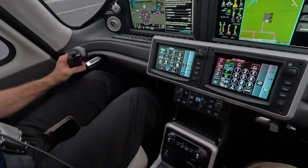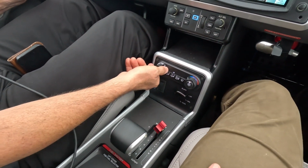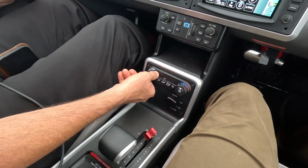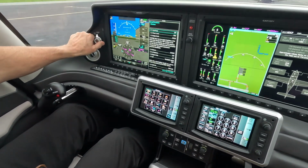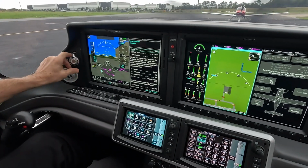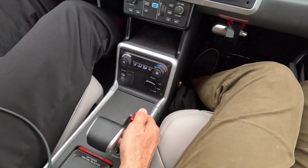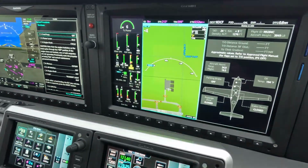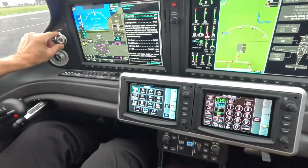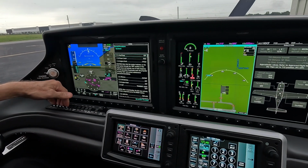From here, we're going to make sure that the AC is turned to OFF. It's one of the highest maintenance failure items we see here at PRP Aviation. So AC coming off. Going to do a hot mag check. Make sure my switches are set appropriately. And then we're going to go to idle cutoff, looking for a tiny rise in RPM during the shutdown process. And there it went up 10. My hand stays on the magneto, coming to off. And then my switches are going to come off.